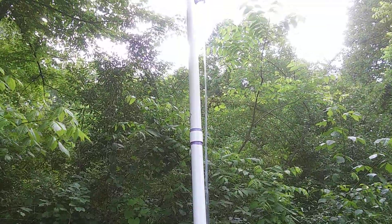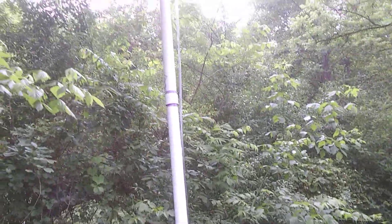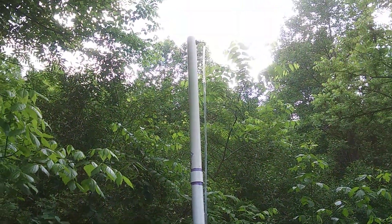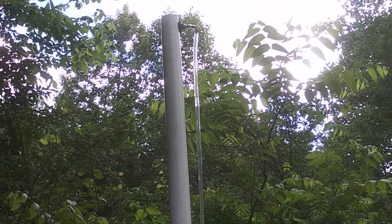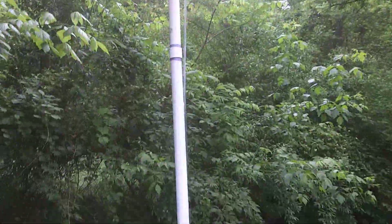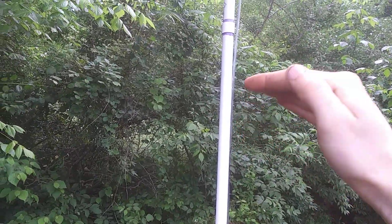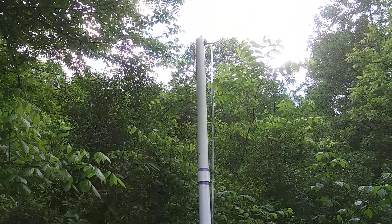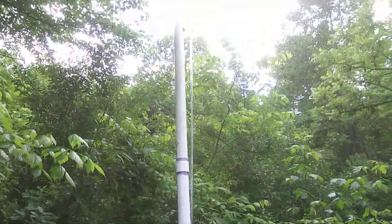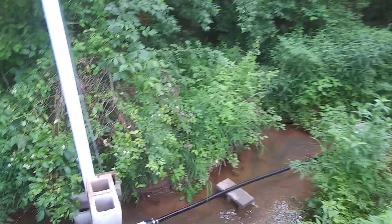The water level in the sight glass is right near the top — about two feet from the top. In the middle of the screen you can make out a little line in that rubber tube — that's where the water level is. While it runs it'll pulse up and down and come down a little bit, but that is the height of my source, the height of the spring, all the way up the hill through the 600 feet of supply line.